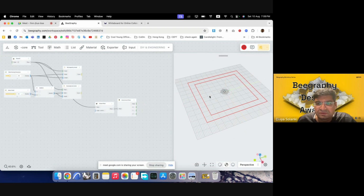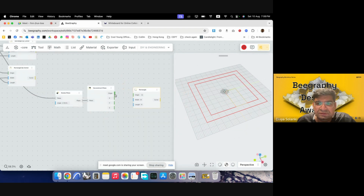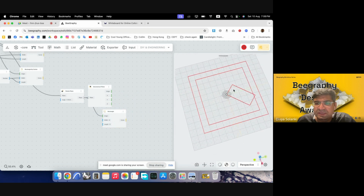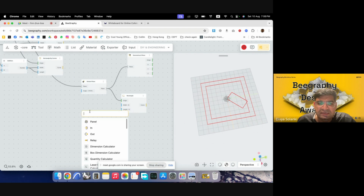So let's make those attachment parts. I'll just type for rectangle, and go with a simple rectangle. The origin point would be the new plane, so that the rectangle is being constructed at an angle to the existing body, and then we can give it a length and a width so that it goes outside the body. For the length I can go for say 50 or 5 centimeters.